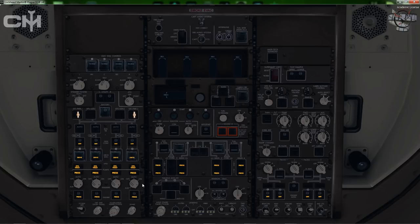Demand pump selectors all need to be off. That's these four here. These are the demand pump selectors. I was confused about that earlier, obviously. Verify that the hydraulic system fault lights are illuminated and that the demand pump pressure lights are illuminated. So both of these lights for all four should be illuminated, which they are. Next, the engine pump switches all need to be on, and then we want to verify that the pressure lights are illuminated. And then there you go, emergency light switch armed, guard closed. That's this guy up over here.